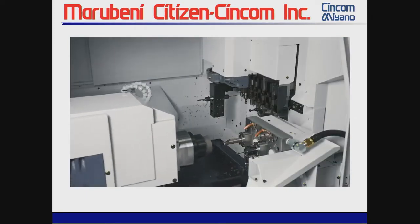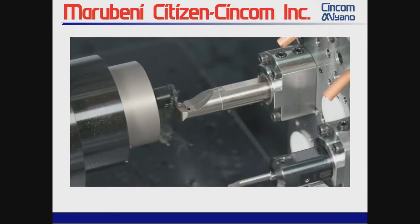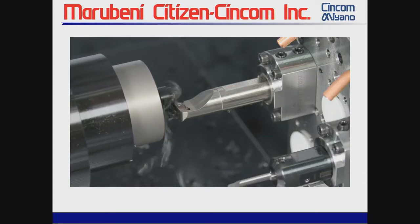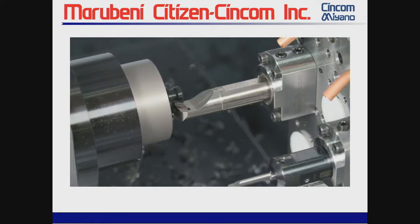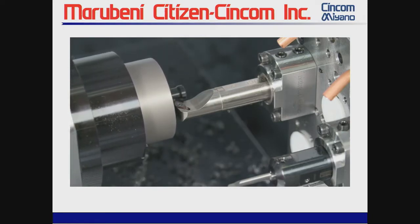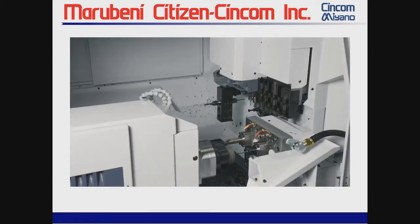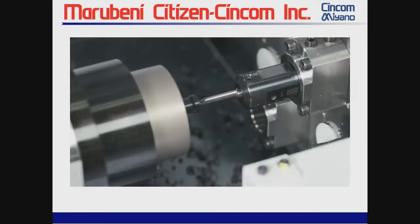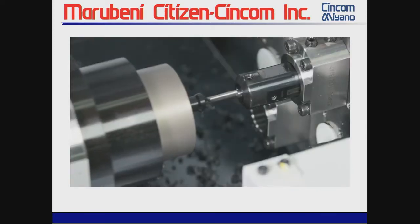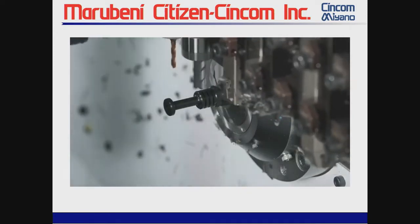The Type 10 and 12 now have LFV on the subspindle side. You can see here, controlling the chips as we do an OD turn. Not a problem with long stringy chips wrapping around the part. Very controlled as they fly right off. ID boring, same situation. Very controlled chips. Not getting long stringy chips. Not going to have a problem with chips being wrapped around the tool when the parts are removed.